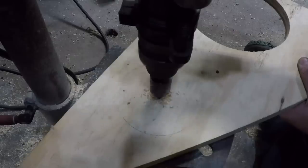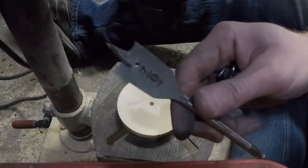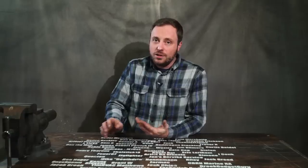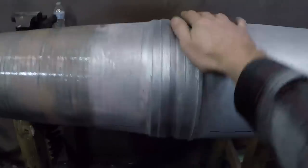I came up with an idea to cut out circles the size of the barrel and rear of the cannon. I used my circle cutter to cut them out exactly to the right size so I could pressure-fit them in. Then I cut a 7/8-inch hole in the center, which is close enough to 22 millimeters to fit in 608 bearings — which are skate bearings. Those have an inner diameter big enough to hang on the rope. After I got all that put together, I could spin the cannon.